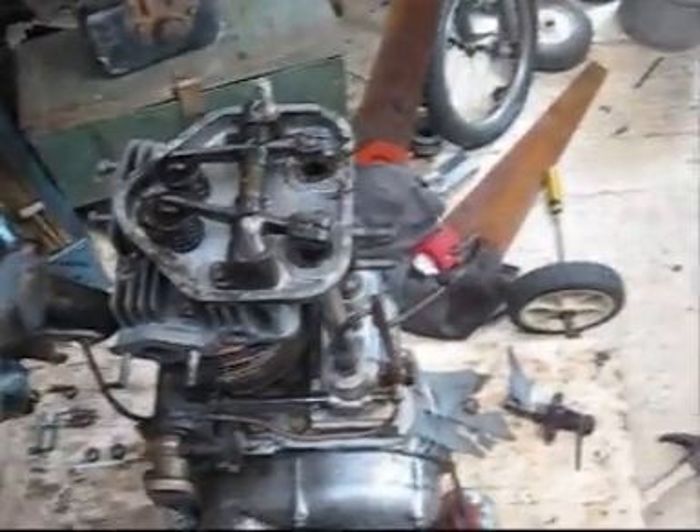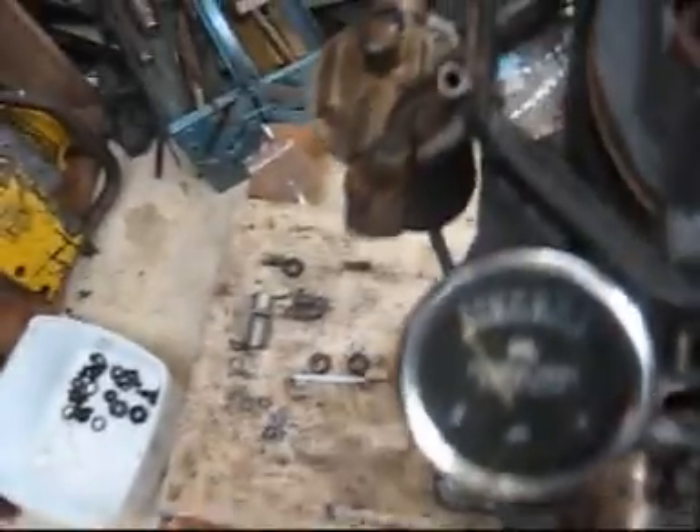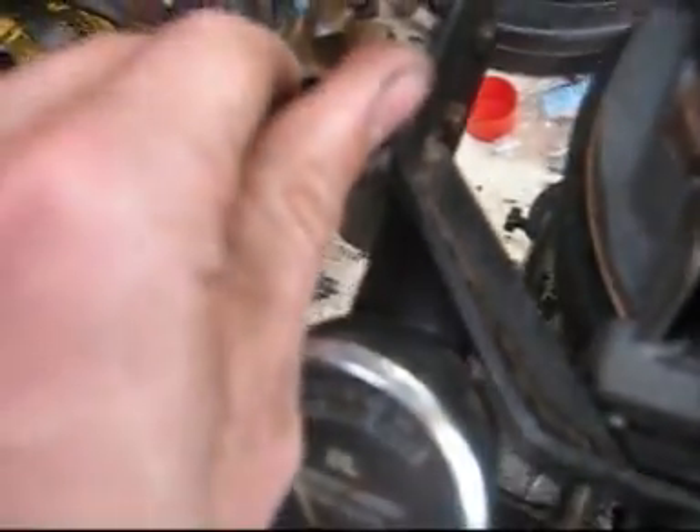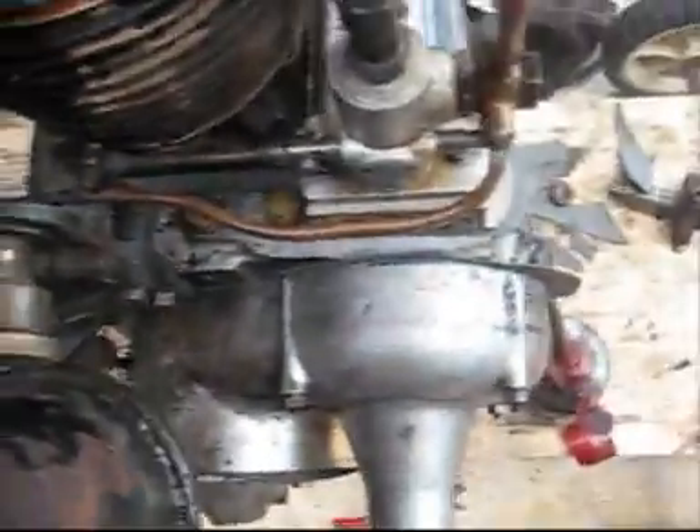From the last video I've put on this fuel line which goes up here. I made a new intake gasket, and I've cleaned the air filter. So now I'm going to put all this on — the air filter goes on, then this piece here, see how it's got that big cut out, sort of slips over it and on, and I'll tighten that up. Then I can almost be ready to test the injector, just by putting a funnel on that and putting fuel in — that's where the fuel goes in from the tank.